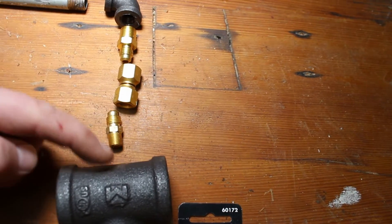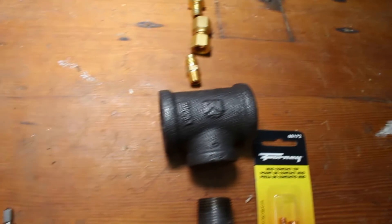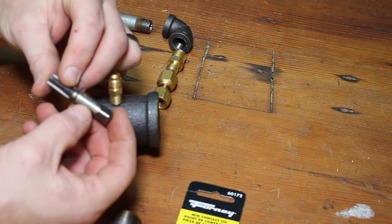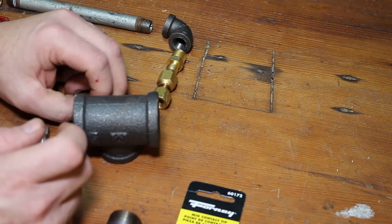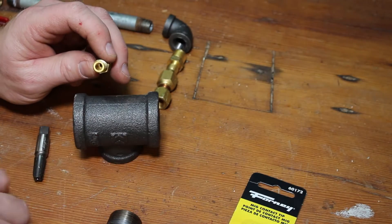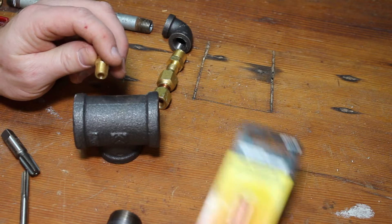You're going to need to tap the T. This is a one-inch to three-quarter-inch T — one inch on both sides and three-quarter inch in the middle. You'll need a tap to tap that eighth-inch pipe thread, specifically an 1/8 by 27 NPT tap. Then inside you're going to use a MIG tip — this is .035 diameter. To tap it so it can screw in, you'll need a quarter by 28 tap to thread the hole for the MIG tip.